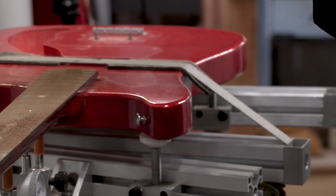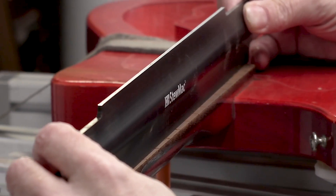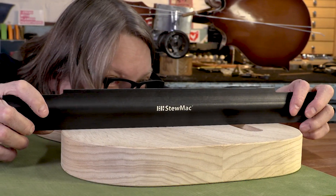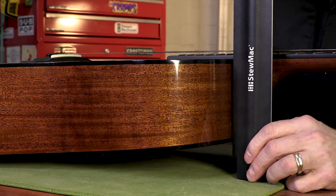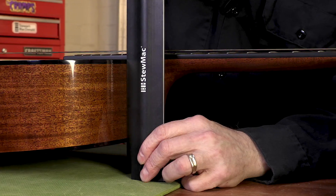When preparing a fingerboard for new frets, I use it to check my sanding progress when working out humps or dips in the wood until the board is dead flat. When you're building an electric guitar, you can know that the body is truly flat for flush mounting the hardware and ensuring everything is going to fit together just right. Use them for checking the flatness of acoustic sides for perfect neck joints and binding channels. Getting your sides dead flat where the cheeks of the heel touches the body is absolutely critical.